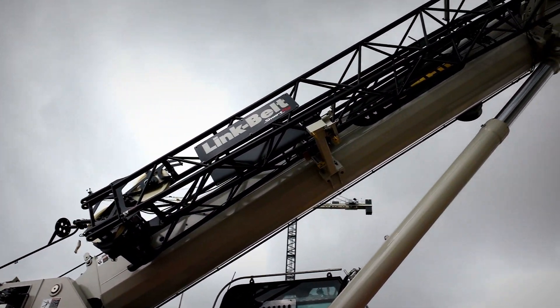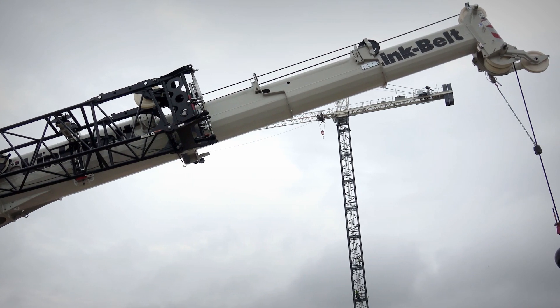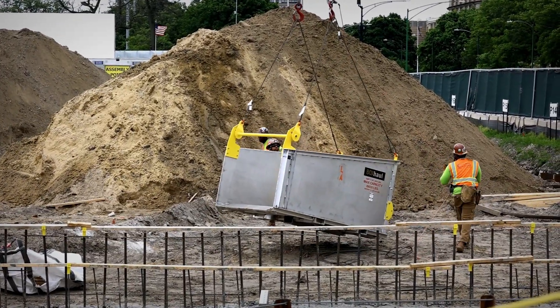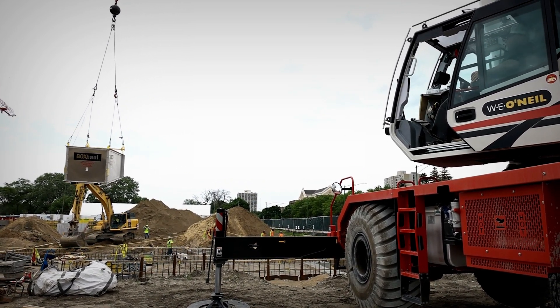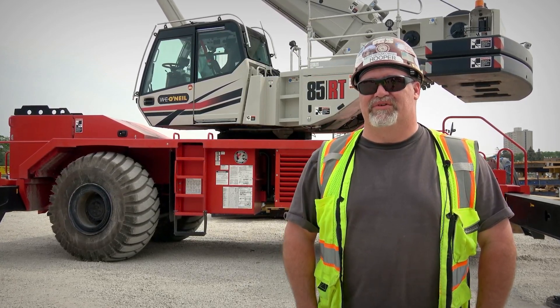I have done quite a bit of fine metering. There were a few times where I was doing some heavy lifts and I had to bring it down slow. I would put the winch speed down on the turtle and actually adjust the fine metering so I could come down a couple of inches at a time without it being real jerky. So as far as setting equipment, you can dial that in pretty nice.